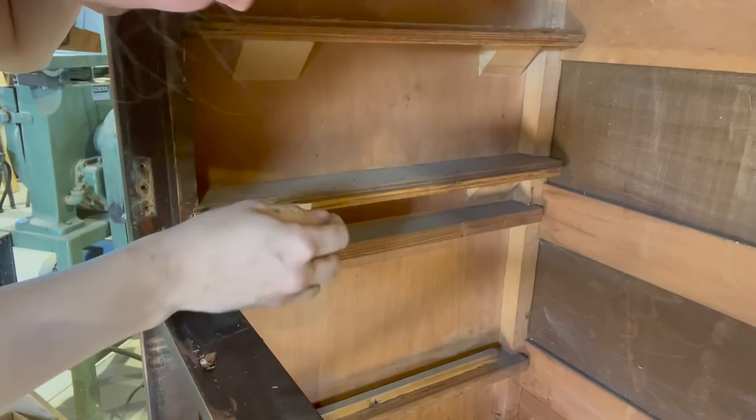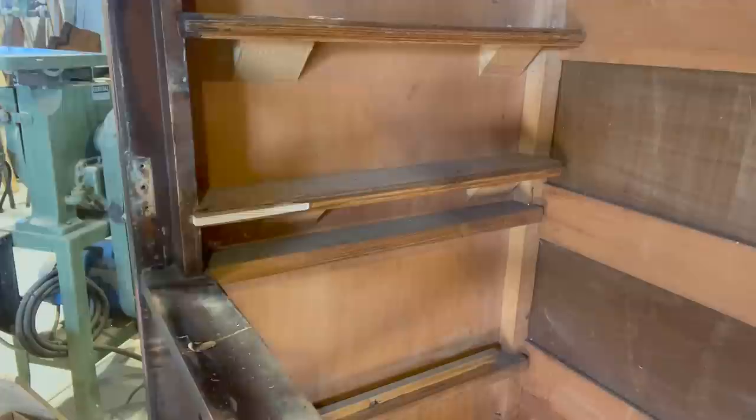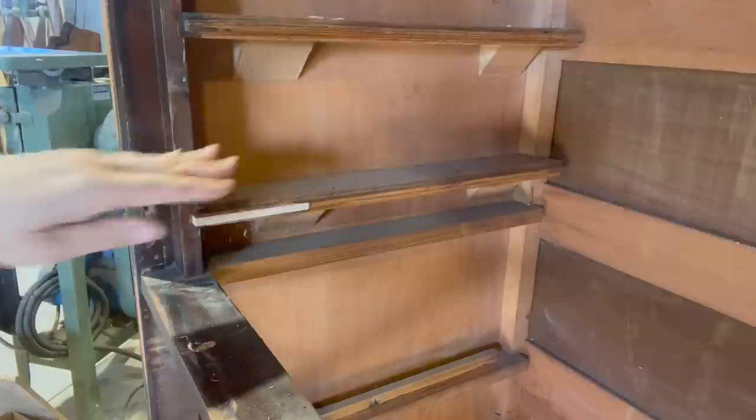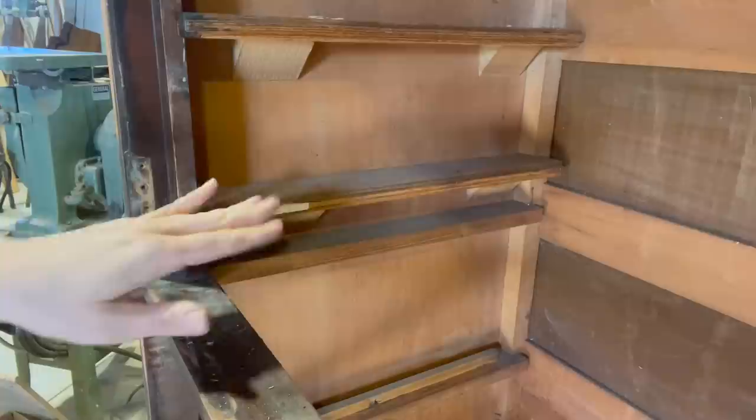So I'll make some epoxy to do all of these glue ups with, I think. No, that's a pretty good fit. Just want to make sure it's strong because, although the rest of this tenon is in good shape and part of this board, this one's going to be relying just on a quarter inch in on each side of this tenon. So a good glue would be excellent here.